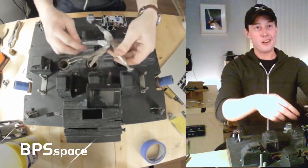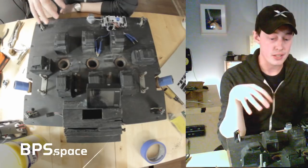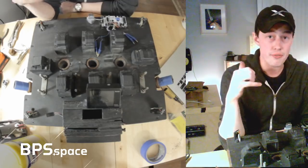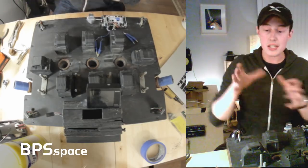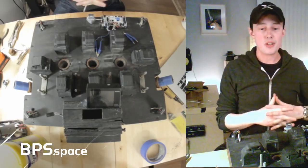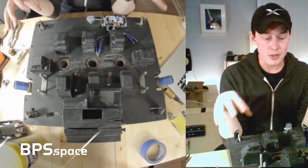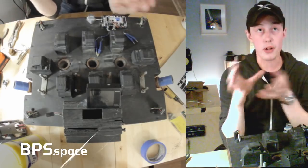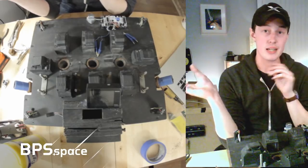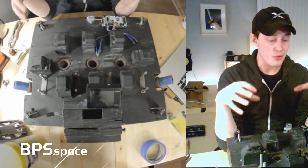Excellent. I use really good hardware. You know what you can look at? Go watch the Ares 1X flight from NASA. They do a bunch of different modes and vibration testing during that flight, and especially when they show the onboard camera, you can see this massive solid rocket motor, this thing that has to be at least 10 stories tall, flexing and bending. So your control software has to be able to understand how the vehicle flexes and bends. And where do you put your orientation sensor? The top of your rocket is at 1 degree and the bottom of your rocket is at -1 degree. You basically want to have as much of your rocket rigid as possible.